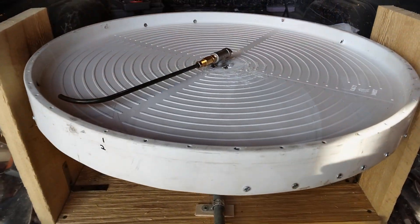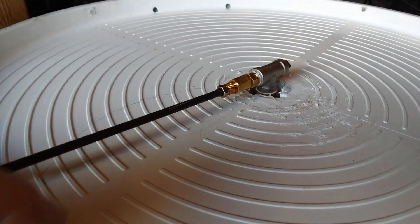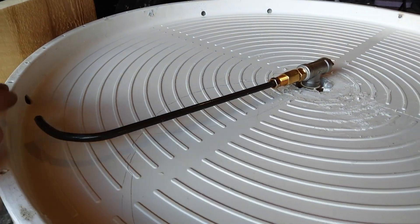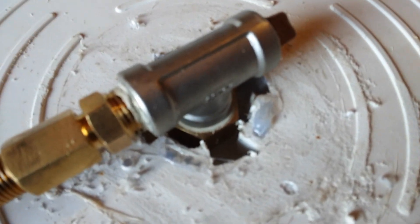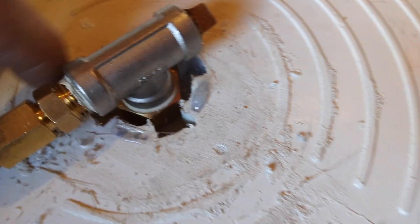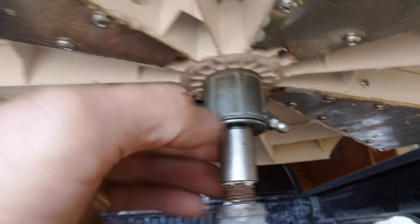On this version of the turbine, I'm going to do some experimenting with just one nozzle arm in this nozzle chamber. I have provisions for another one if I want, but I'm going to do more experimenting with just one. This is just some quarter-inch brake line. Down in the center here I got a nylon bushing to help seal this chamber up. Underneath, I got this packed full of water repellent grease like I did before.